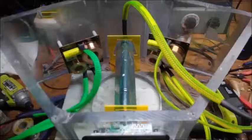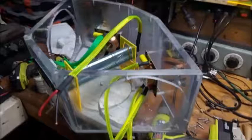The fluorescent looming and the fluorescent acrylic going in. I figured, why not use that? Put some ultraviolet lights in it, give it a little bit of bling. And the acrylic welds beautifully right down to the polycarbonate. And that's with methylene chloride.